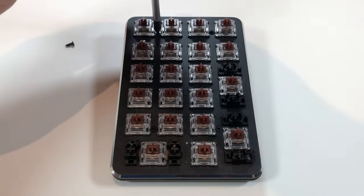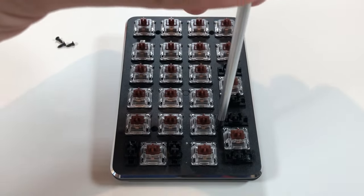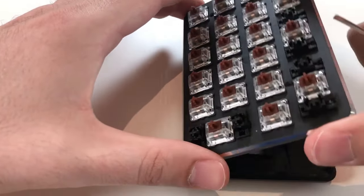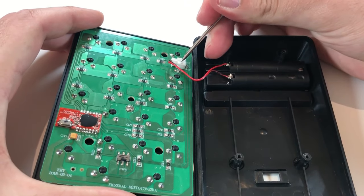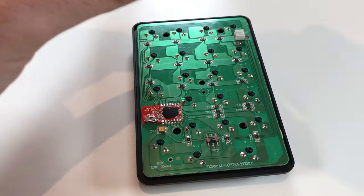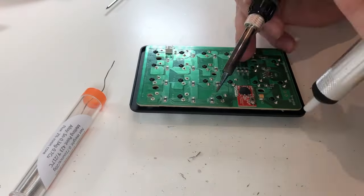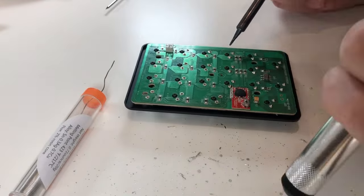So the first step was to decide which keyboard I was going to use and then disassemble it so that I can measure the dimensions of the PCB and integrate that into my CAD model. All keys, with the exception of the num lock key, were desoldered and replaced with momentary push buttons in a later stage.